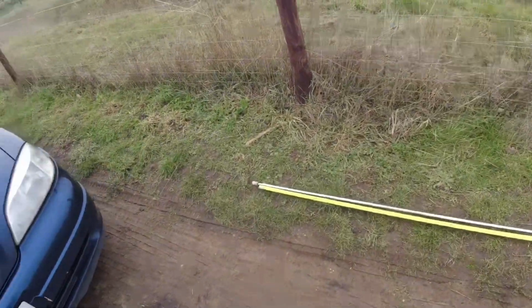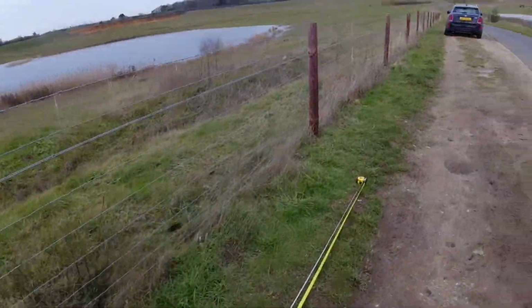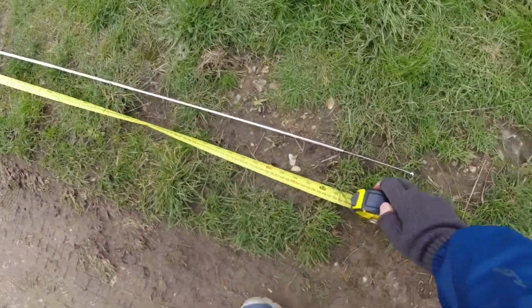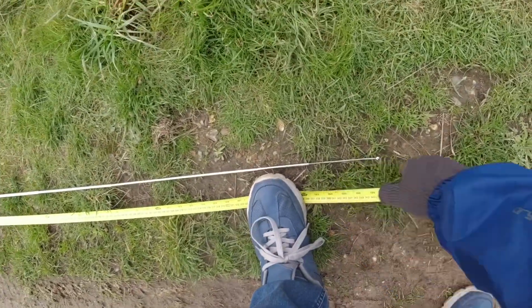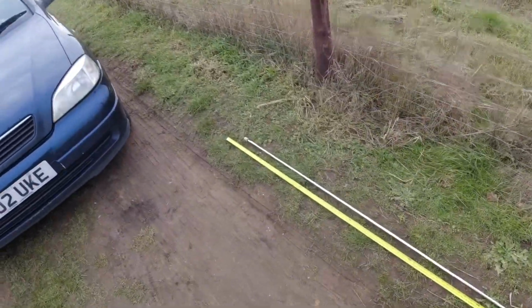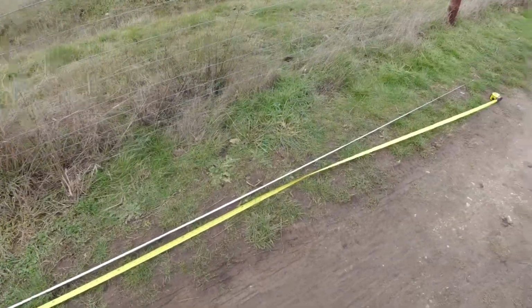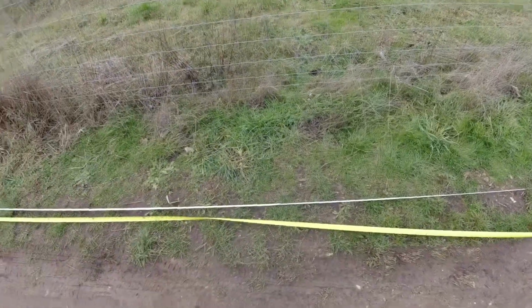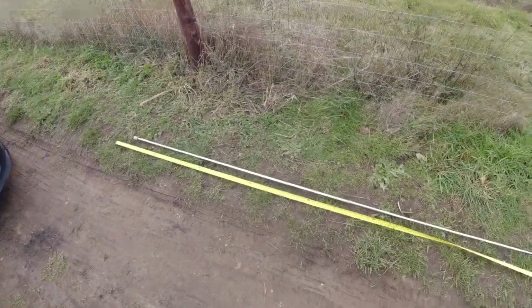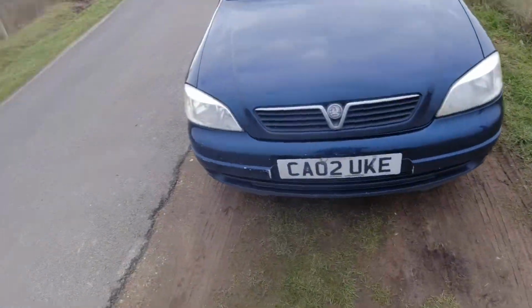Okay, so I've changed the whip length now to 337 centimetres. Conveniently, actually, on the Moonraker website, to save you getting your calculator out, it's got the whip lengths already written down in the description. Anyway, I'll put a link to the Moonraker website in the description, and so that should be okay now.